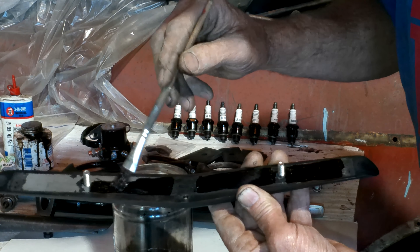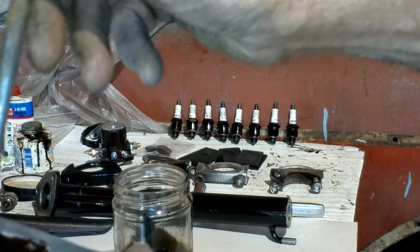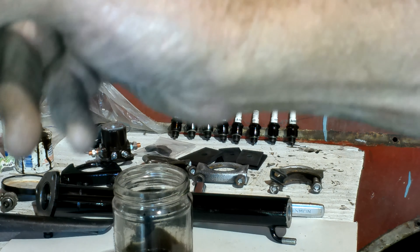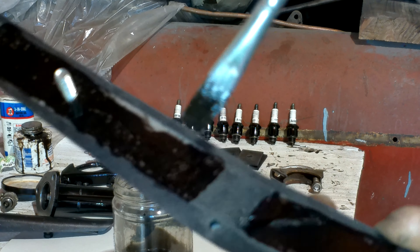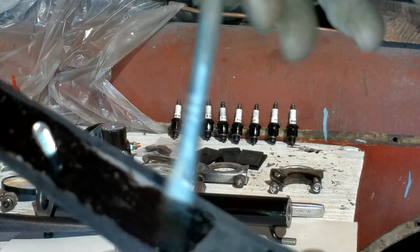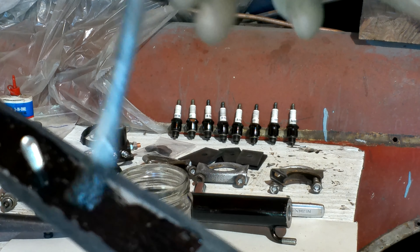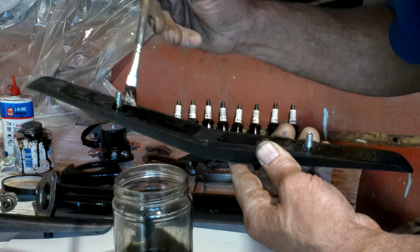The paint's not taking - see that? It means there's a little bit of oil or some impurity there. In paint they call that fisheye, which means there's a little oil or something on the metal. But I washed them off with gas - okay, that looks good.